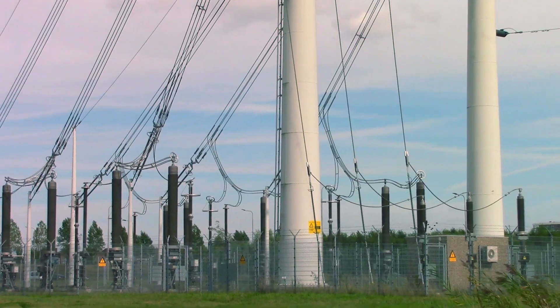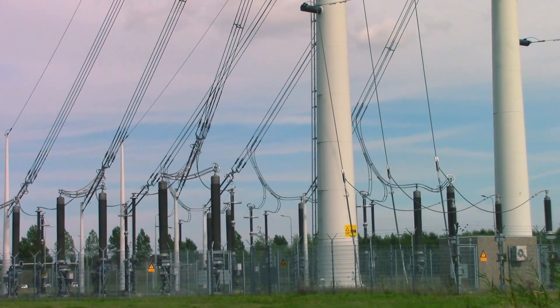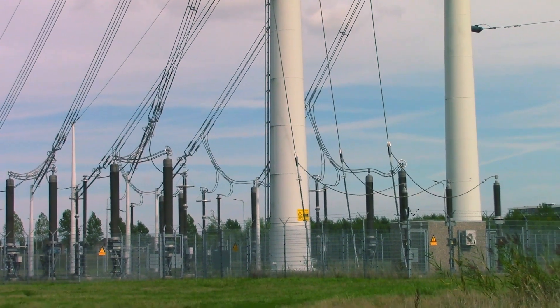Of course, as you can see there are no electric arcs here, because the designers made sure to put the wires plenty far apart and far from the ground. But the fact that there is no arc doesn't mean that the electric field can't be strong enough to ionize air locally — particularly close to sharp points and edges on conductors, you can get something called corona discharge, where charge leaks away from the conductor into the surrounding air, representing an energy loss.